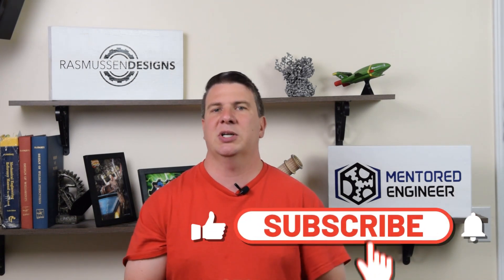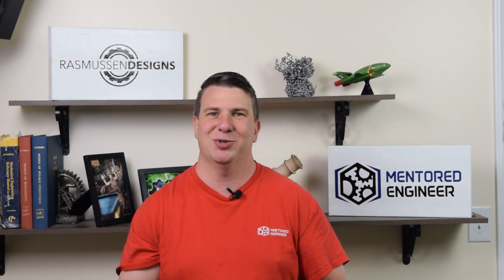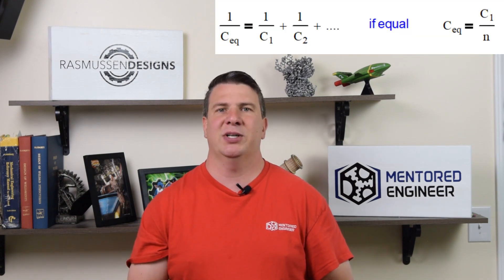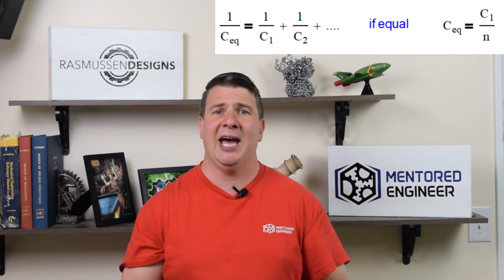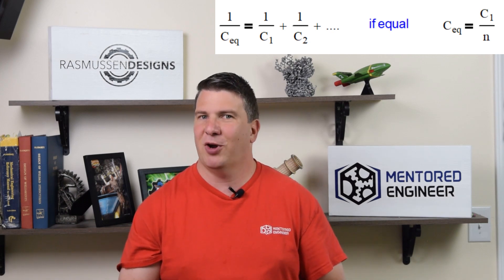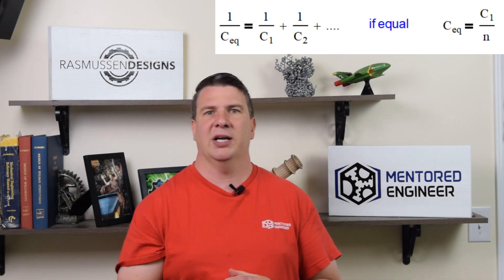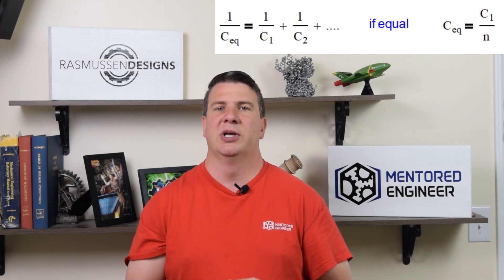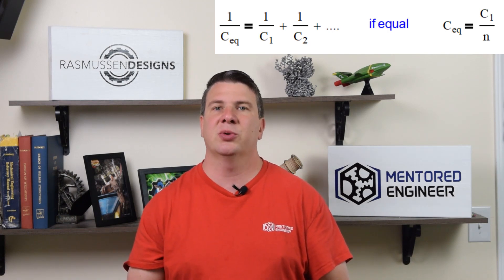I want to give myself a little breathing room, so we're actually going to increase that number from 36 to 40 so I don't have to worry about my capacitors blowing. Now when you put a bunch of capacitors in series we actually do ourselves a disservice - the capacitance will drop every time we add one in series. If I have two 10-farad capacitors in series I actually drop my capacitance by half to five farads. Using this equation here is how you calculate that, and we can simplify it if all the capacitances are equal. We take the individual capacitance divided by the number of capacitors and that equals our total capacitance.